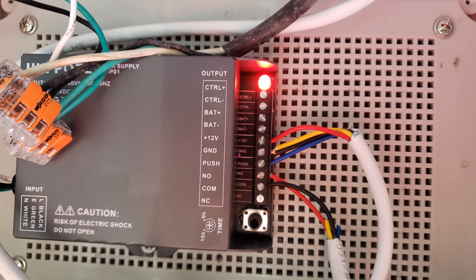The power supply requires 120V input, so we're using these thick computer cables that have three wires going in: black for the load, white for neutral, and green for ground. Connect green to green, black to black, white to white, and now you have power once you plug this computer cable into the power outlet. You know you have power because this red LED will stay on.